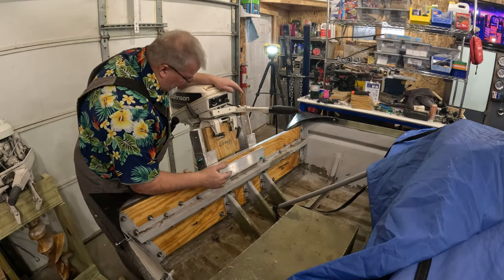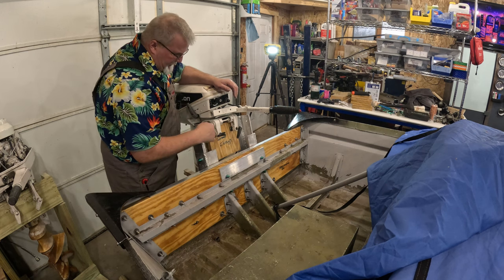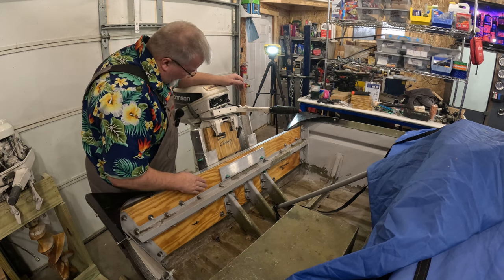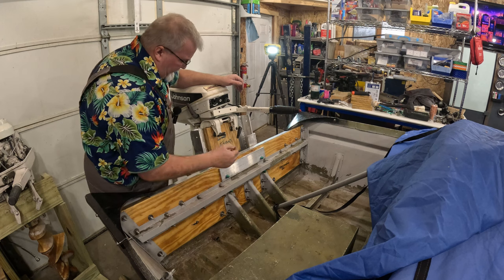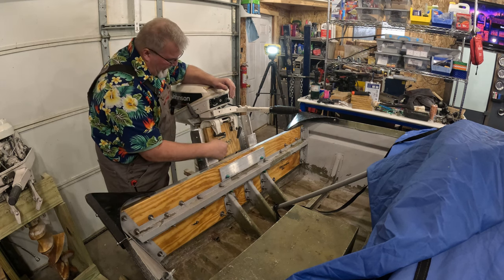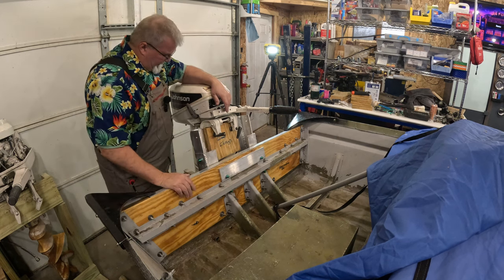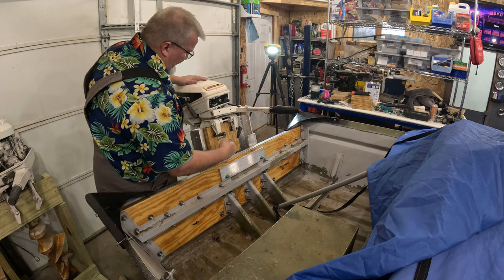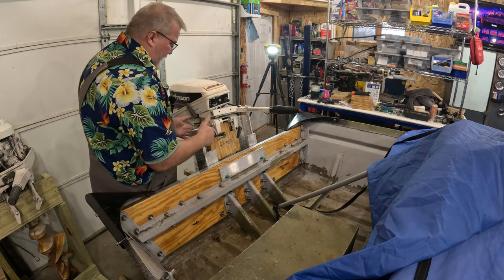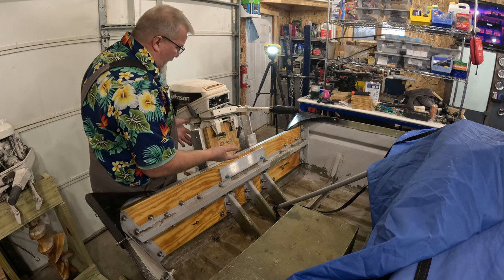Now, some of the other features we'll talk about here is this wooden block I put here. This is the exact same plywood material that I used for the transom. I've got it screwed and glued and covered in resin. And right here it says good enough, because that's what it is. It's going to be good enough. A lot of people use different blocks. I could have used a resin block of some sort, plastic. That may be changed out someday.